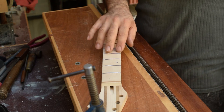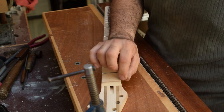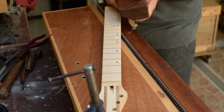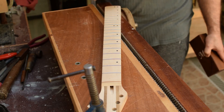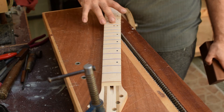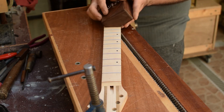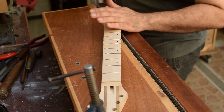I'm checking the edge of the fretboard. When I have a small chamfer on the edge of the fretboard, I know that I'm at the right point and I don't need to go any further. The end part of the fretboard is the part that will take more work, because there is more material to remove in that area. That's why I like to finish up the upper part first and then tackle the end part on its own.